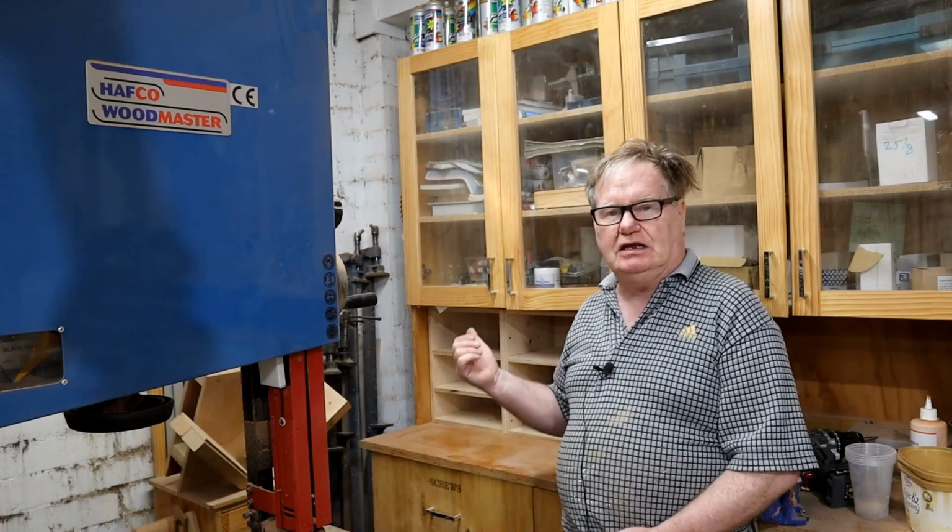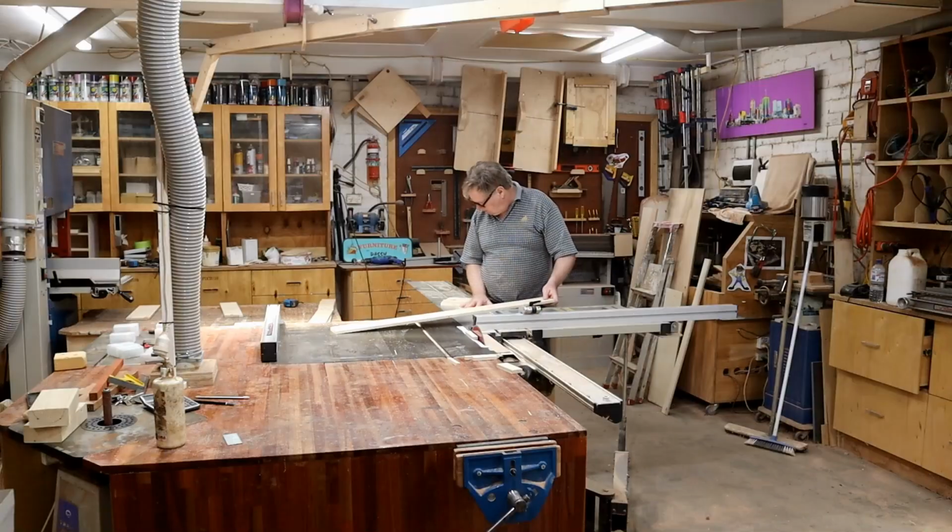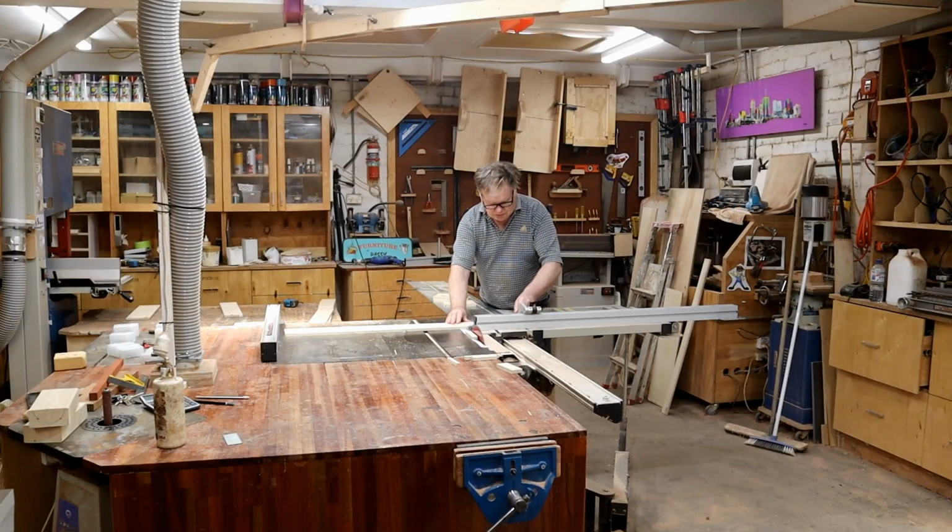The carcass is made here behind me. I'll cut the drawer size to fit in the holes. I'll make them out of 1/2" birch ply too. And then we'll make the drawers as normal, fit them in the holes, and then I'll make the fronts. Just docking the drawers now.